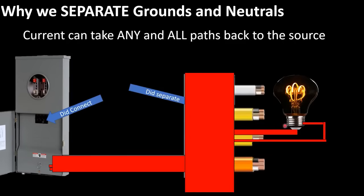So instead of the current leaving the breaker, hitting the neutral, and riding back on an insulated conductor all the way to the source — it left the breaker, hit here, could have flowed on this metal box back, flowed all the way here, hit the can, all of the metal components here, could have temporarily flowed on any one of the bare grounds inside of that panel, flowed back on the ground and the neutral conductor and on the piece of rigid metal pipe coming back to the source, and anything else metal it was touching on the way back. If this was mounted to a metal stud building, it could have flowed on the metal stud building on the way back.